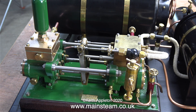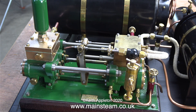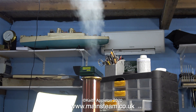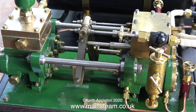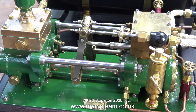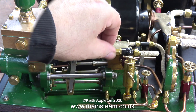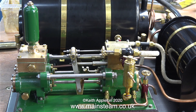It's time to look at the pump and, not unsurprisingly, it's behaving exactly the same way on steam as it did on compressed air. This is the best it will do, pumping against possibly 40 pounds per square inch, and I have to give it a push now and again, which is definitely not a good idea. When the pump stalls and can't pump water into the boiler, lots of steam comes out of the chimney, which tells me it can be one of three things: the piston rings could be worn out, the slide valves are not sealing on the ports, or the gasket could be leaking underneath the steam port block — because underneath the steam port block are some special steamways that channel the steam from one cylinder to the other. I'll do a feature video as I fix the pump once and for all.